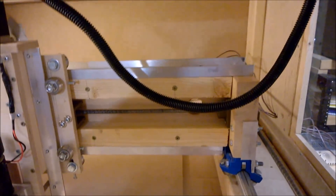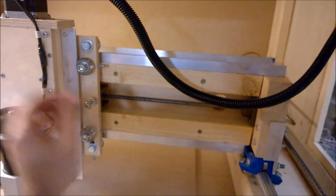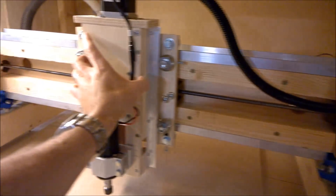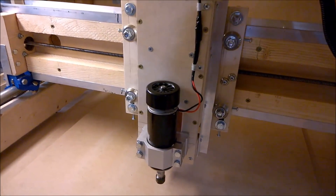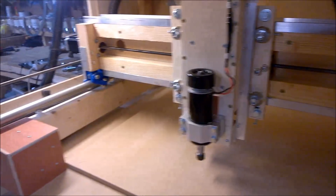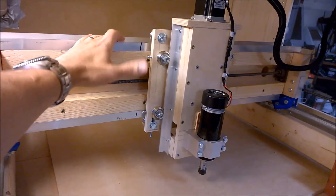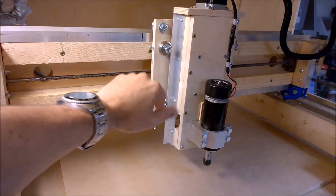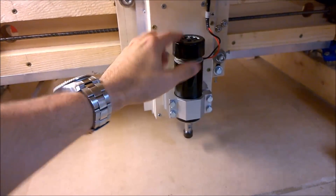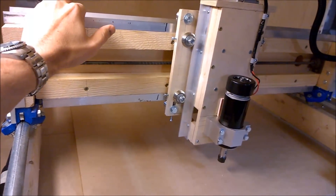Originally when I was sketching this out, I figured I would need two L-channel brackets to really keep this tight — one on the back and one on the front. But I found this was really, really secure with just the one. After doing some more research and looking at a few different designs, there are some very nice DIY machines that just use the one on the front. There's no torquing that I can tell from front to back, and I don't have a real heavy router on the front, so I think the one will hold it pretty tight.